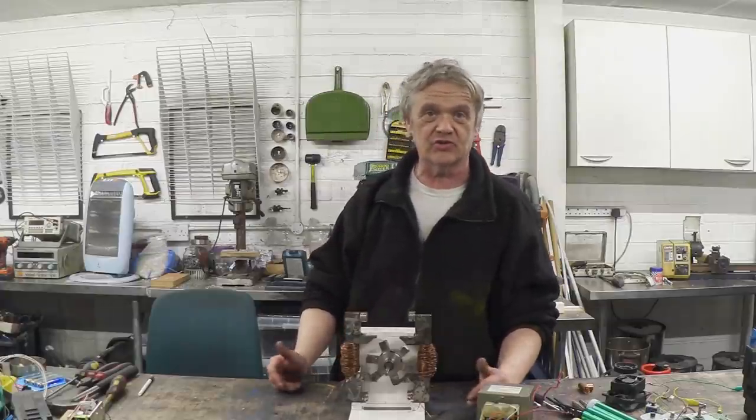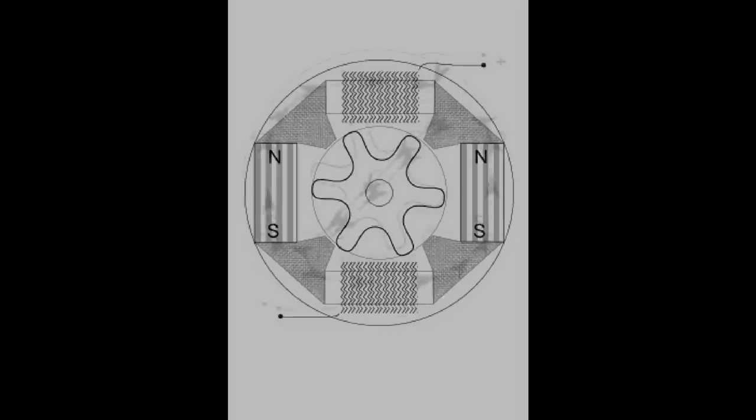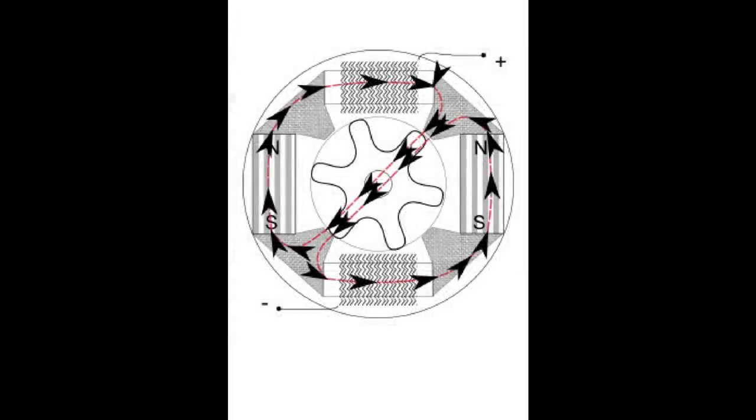Now let me go through a few diagrams to help you see how this works. In this picture you can see the magnet arrangement and the coil arrangements with the rotor off-aligned and of course nothing happens. If that rotor moves however to this position, we now have a path for the magnetic flux to move, so that magnetic flux can now follow the arrows going north-south, north-south as it wants to do, and to do that it flows through those two coils. What we've got there is a changing magnetic field so we get a plus and a minus out.